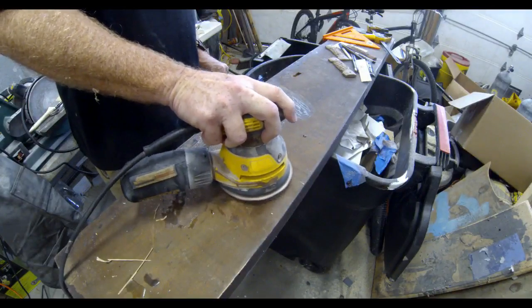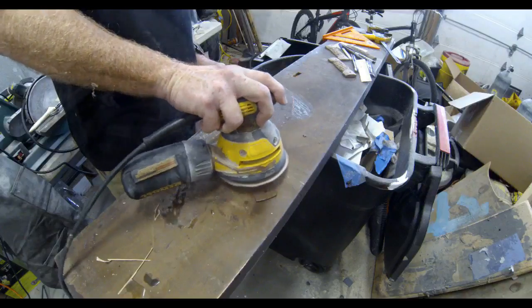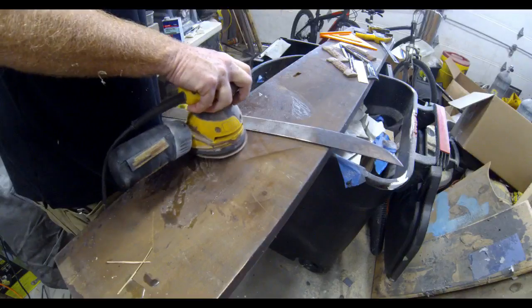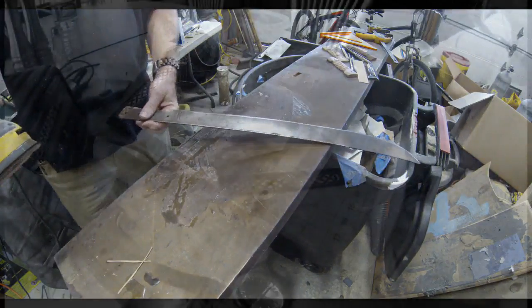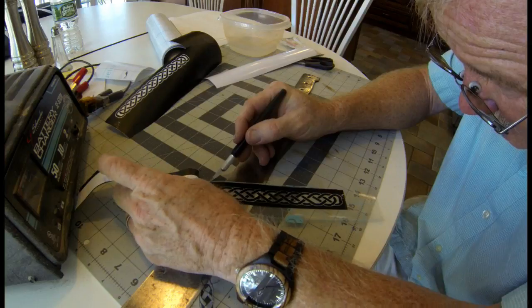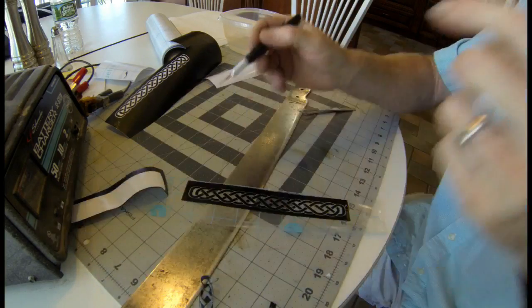Now I'm going to move back over to the blade. I popped off the handles and I'm going to use an oscillating sander — I think it had an 80-grit paper in it — just to clean it up a little bit, get off some of the rust. I'm not going to get rid of all the pitting, but I am going to get rid of some of the bang marks on the blade itself, and get it polished to a point where I can etch the blade successfully.